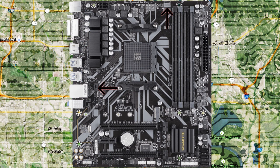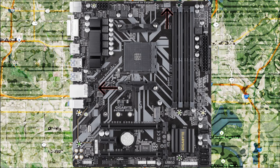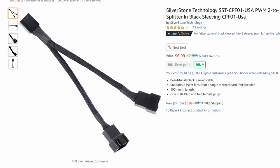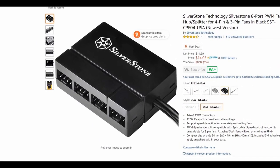There are two fan headers in total. Both are 4-pin PWM hybrid fan headers, meaning you can control just about anything that uses the header to cool your PC, such as an AIO, a pump, a CPU fan, or a case fan. I would have liked one additional fan header. I definitely recommend either buying some fan splitters or a fan hub to accommodate more than one case fan, as one header will be taken by the CPU cooler.